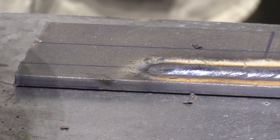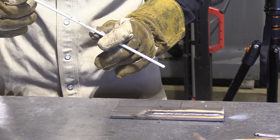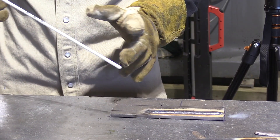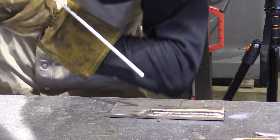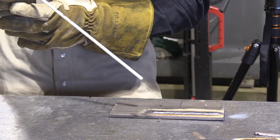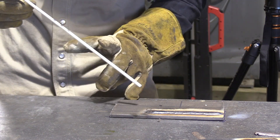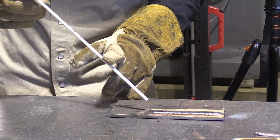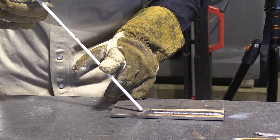Now we'll show a restart, because this is an education channel and a lot of students will watch this. One of the most important things you can learn when you're learning to weld — and it pays off big dividends — is to learn how to make a decent restart. This is my good friend Andrew Carden doing the welding today. A lot of students would hold the electrode with both hands on the electrode holder, propping with the elbow, and that only gives you a certain amount of control. If you're welding on a bench or even on a pipe joint, you can prop with the hand that you're not holding the stinger in — prop with your pinky and put a little pressure on that one finger. It gives you a lot more control on a restart.